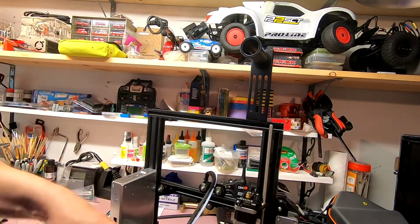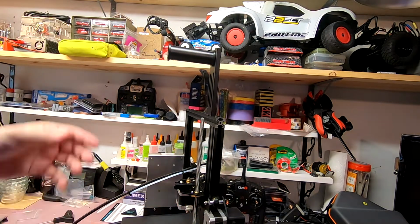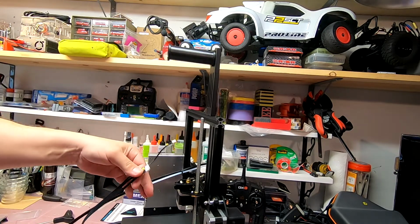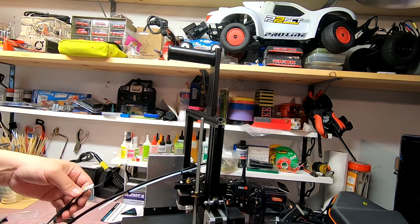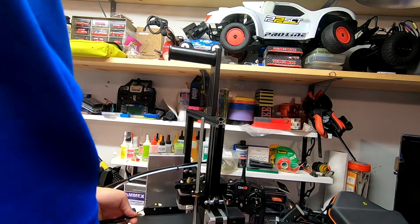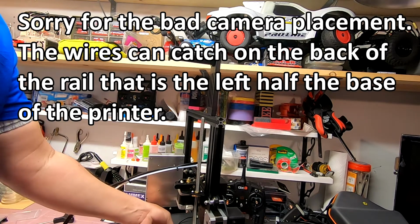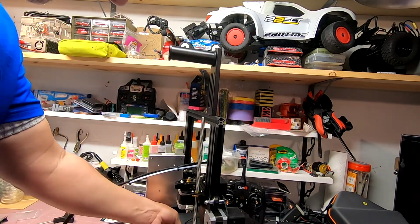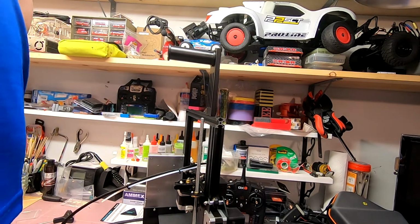So go ahead and let's look at wiring. Now, wiring seems to be a big thorn on the 3 and the 3 Pro. For example, I mentioned at the beginning of the video the fixture that provides a way to keep these cables from running up on, like, see how this cable could potentially catch on here. On the other design, it was more prone to it. That may be why they've got this new plastic piece here. In any event, that was a problem, and so there are fixes for all of these things that you can print out for free or for the cost of the filament.